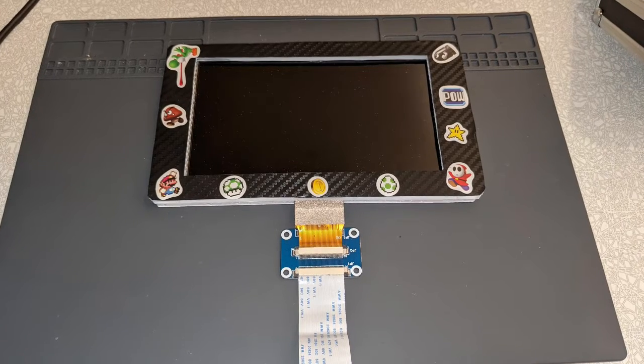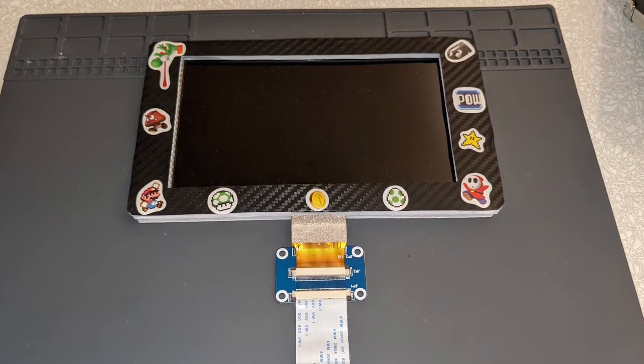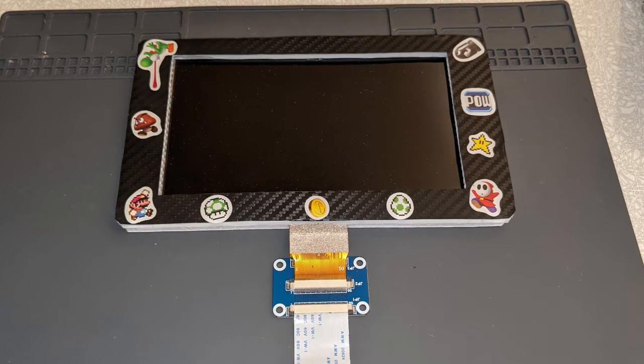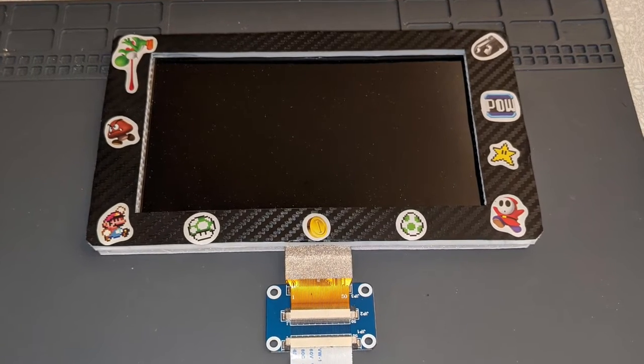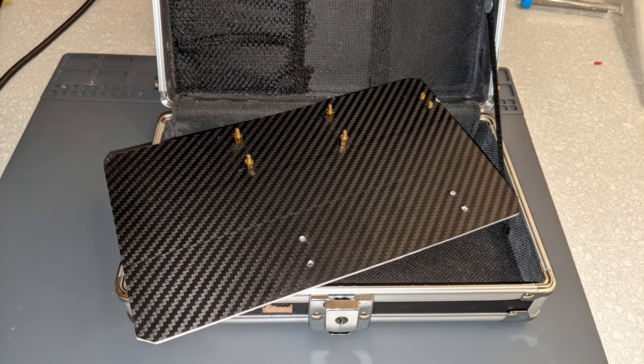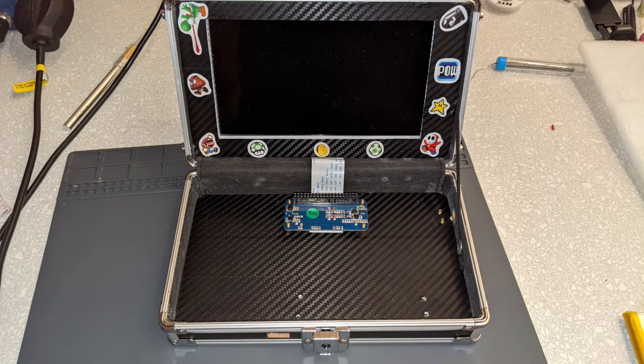For the screen, I have a Waveshare 7-inch IPS screen that utilizes a GPIO hat for the display signal. This does require modifying the system's config file to properly display — the screen comes with a link to these instructions, and it's pretty easy to do. I have a few shots of how I mounted the screen and components inside the case, and if you'd like a more detailed explanation on this technique, I highly recommend you check out the video on my channel where I detailed building PencilPie's big brother, the cased RetroPie. Part 1 of that video details how I mount these screens in the cases. I hope to have a Part 2 uploaded soon, so please subscribe if interested.